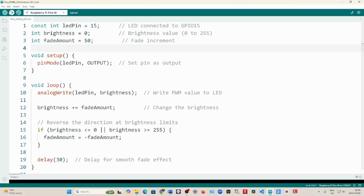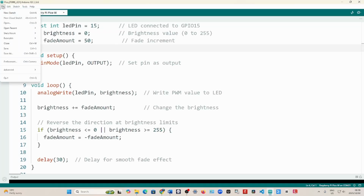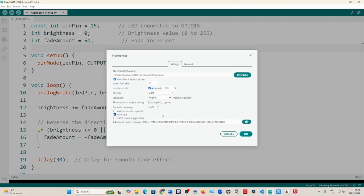Okay, now you open the Arduino IDE, and then under Preferences, go to File, Preferences, and you add the Additional Boards Manager URL. You type it in here. Here you put the URL that is in the description of the video.